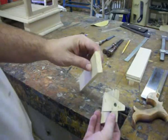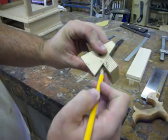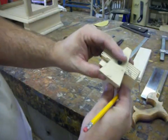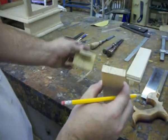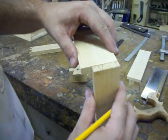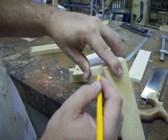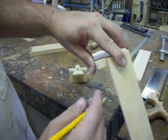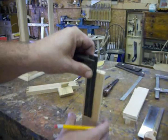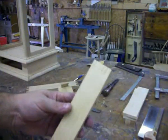Now we're ready to start with the dovetail marker and this is the back. The back has to be done a certain way — you start it just like you normally do and draw your pencil line across. But instead of going to the opposite side, you just pull it down and then come back and do one pin. Since the back is so much shorter, this is the best way to make it look right. You can see here I'm just lining up to clip off that little bit of waste down at the bottom side. Right here is where the drawer bottom should go and pass through. Now we just want to take the square and go straight down to the scribe line.